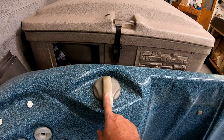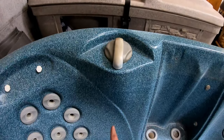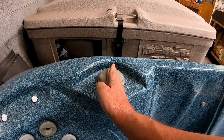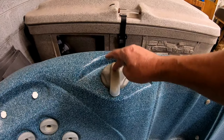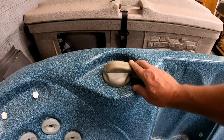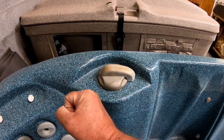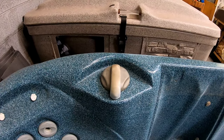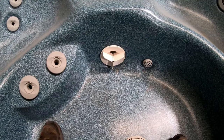Number three: this is the diverter valve. The diverter valve turns both ways — it's a 180-degree rotation. The water comes up from the pumps and it can either go one way or the other. If you put it in the center, it's equally balanced so the water can escape through the two lines underneath, which can be anywhere from a one-and-a-half-inch to a two-inch line. If you close off one side, that can cause an airlock, so make sure the diverter valve is right in the center before you fill up the hot tub.